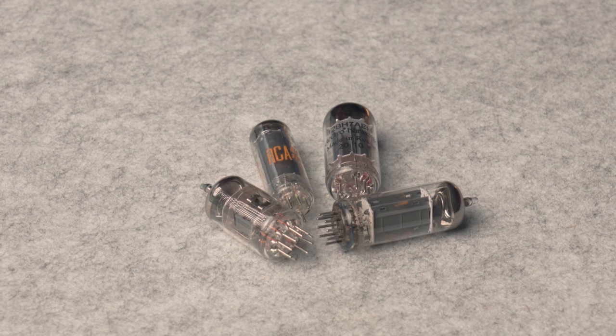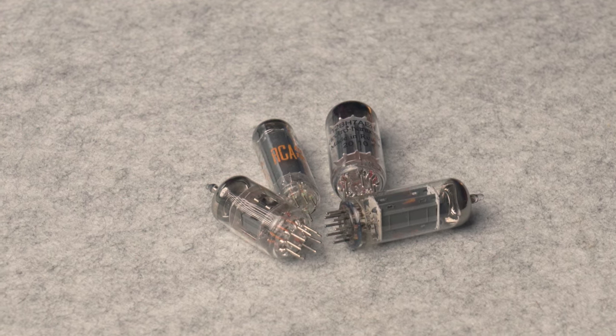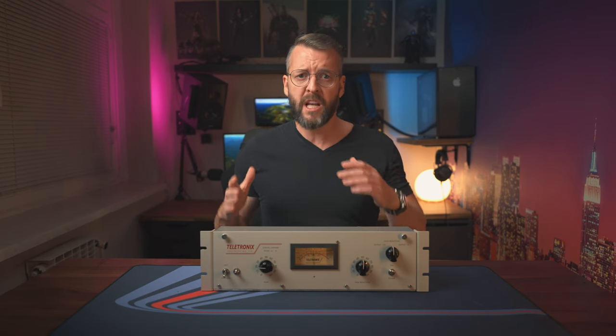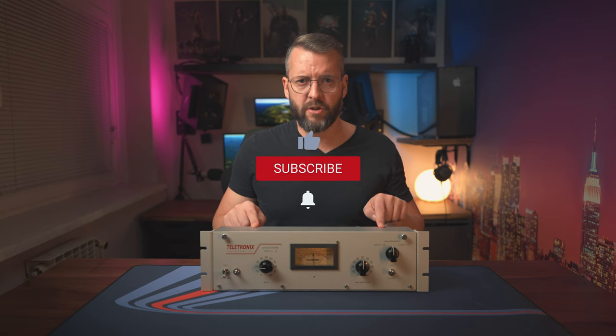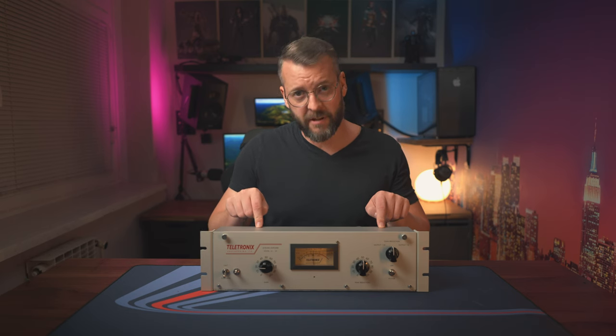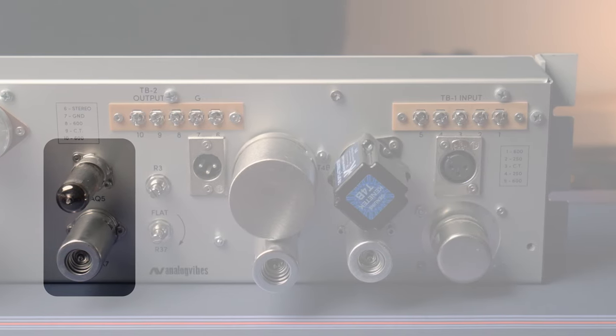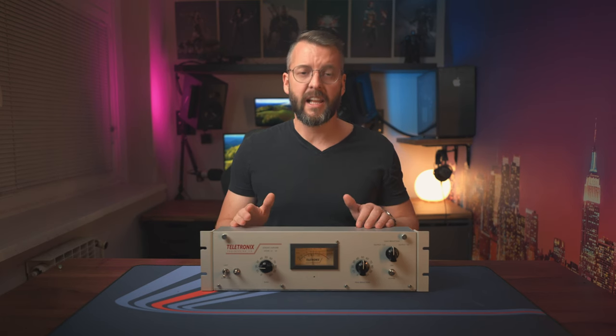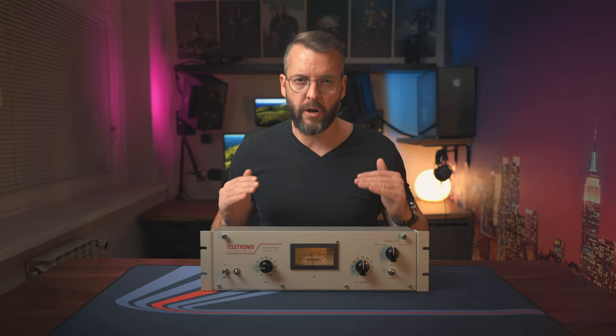The next relevant element are the tubes. If you follow any kind of audio related content here on YouTube, you will know that many people swear by them as they give a certain warmth to the signal. The ones that usually sound the best are also the ones that are really old but never used — the term for these is new old stock, or NOS for short. My particular tubes are from the year 1976 and each of the four I have in here costs around $100. Two of these tubes are used to amplify the side chain, and two are used to amplify the output gain, also known as makeup gain. Makeup gain is the other side of the coin when it comes to compression — it's how much you amplify the signal after it has been compressed, lifting the average loudness.